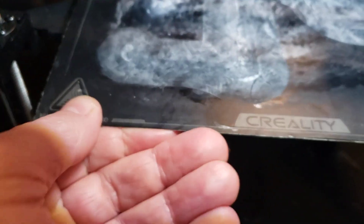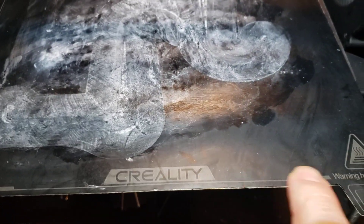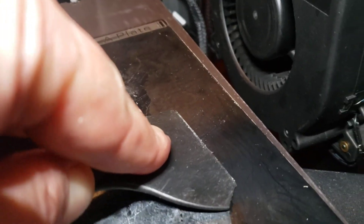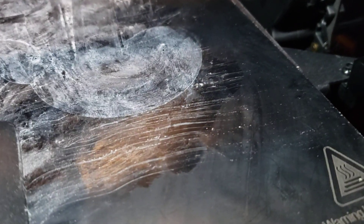At first I just thought the bed surface was deformed, but the steel wasn't deformed — it was just the sticker. This is basically just a sticker with a high-temperature, but not quite high enough temperature, adhesive. I'm trying to push it down around the edges and squeegee it. Look at all these bubbles — that's from exactly what I'm talking about. This whole thing was peeled right off.